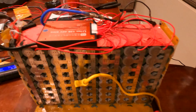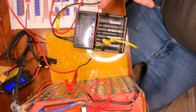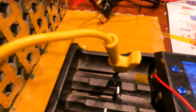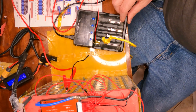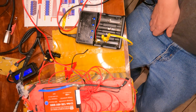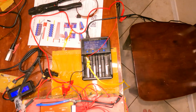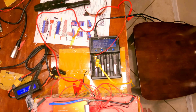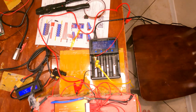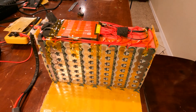I'm going to use an old trick: I've got alligator clips hooked up to the low cell, which is the eighth one, connected to an 18650 battery charger. I'm going to plug that in and try to charge that individual cell up to 4.2 volts. A hobby charger would work better, but this is what I have on hand — I have a few of these from back when I used to vape. So I'm going to try to balance that cell out and get it a little bit closer. You can see with it plugged in now it reads 4.12 volts.